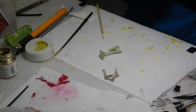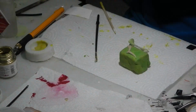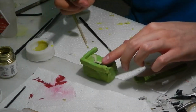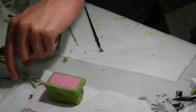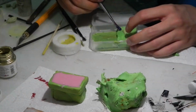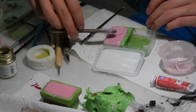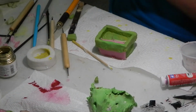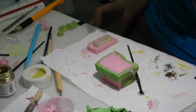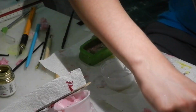The V mold was a bit unusual. I made the mold in sort of an open book shape. First, I placed the silicone on one side, and while it hardened, I made a traditional mold for the goblet piece with a plasticine division. Once the first side of the V was solid, I turned it 90 degrees and made the second side. Then I simply made the other piece for the centerpiece mold.